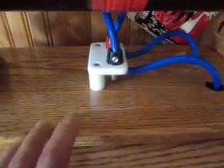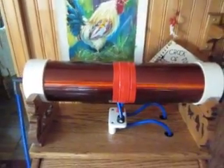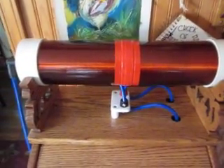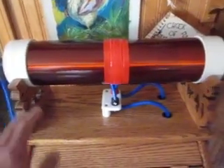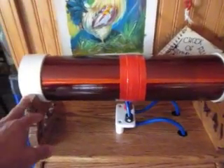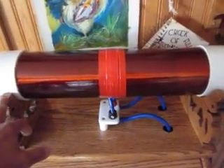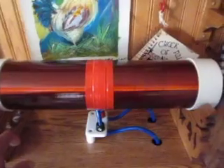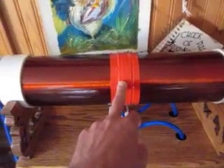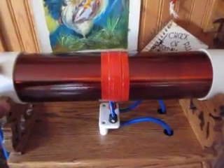Just finished making this stand terminal yesterday. My first coil doesn't have to be that big, but when I started making this a couple months ago the only wire I had available was AWG 26, so to get the frequency I was looking for I had to make the whole thing bigger. It's a perfectly symmetric bipolar Tesla coil with a closely coupled primary sitting right between two secondaries, made on a four-inch PVC former.